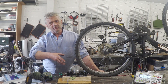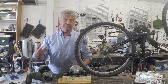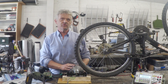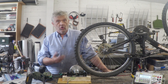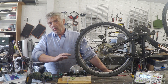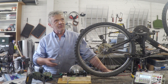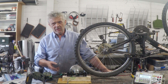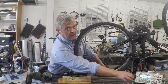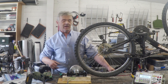I've rigged it up in a simple jig where a large bicycle wheel rubs against the motor, effectively acting as a gear. Every one turn of the wheel gives us about six or seven turns of the motor. We pay for speed with torque, so it'll be harder to turn, but the motor will spin much faster. I'm expecting something like 30 to 40 volts and about 30 to 40 milliamps. The meter is right there and Luke will call out the voltage.